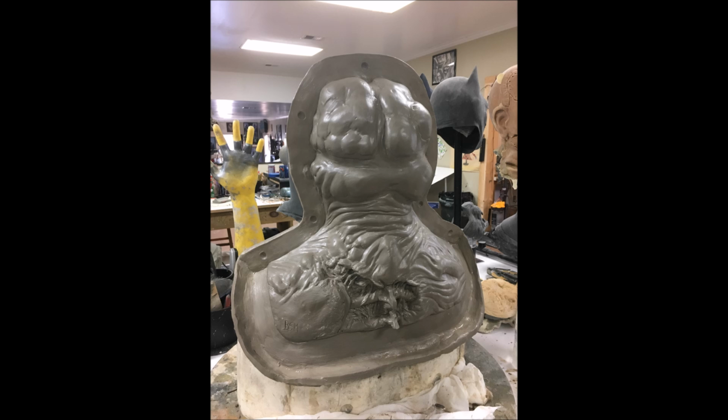we go ahead and spray the entire sculpture and the clay wall with a light coat of acrylic gloss like Crystal Clear or matte finish or dulling spray. Any of that stuff will work just fine. The idea is it just helps the clay, since it's a water-based clay, it helps the moisture release itself from the stone after the mold is complete. It just saves you a little bit of extra elbow grease on the cleanup time, that's all. But if you don't have that stuff laying around, you don't have to worry about it.